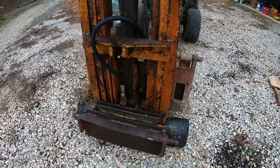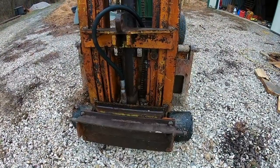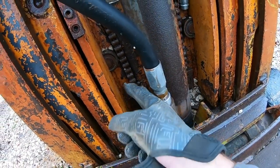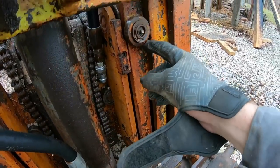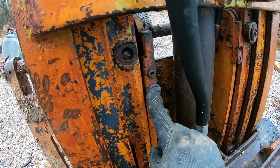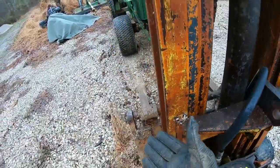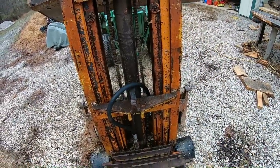So it looks like it comes back - that's the back plate there, you can see in there, and then these plates come back and they've got the rollers on it so it can ride on the mast. See those rollers right on the edge of that steel. And these two little fellers - they almost look like stops. So I'm going to see if I can take those two off and if we can't just slide that whole back plate right off the top end, we'll lay it down to do it.